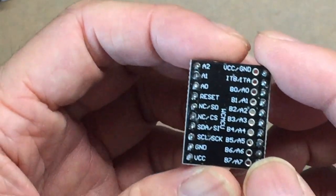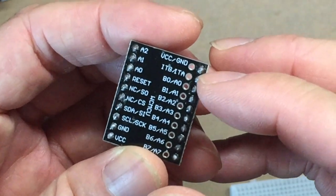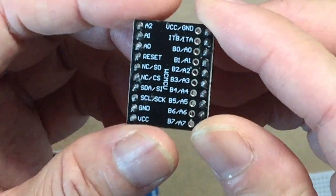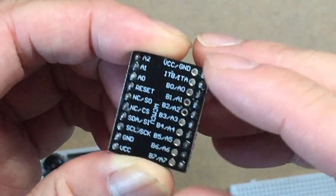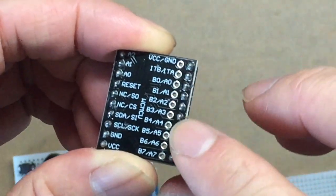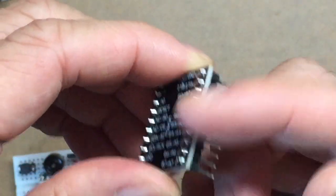And luckily the rightmost row of pins is for the A0 to A7 that we need to control all the buttons. The B0 to B7 are used for some other functions, like in the expansion port, controlling the brightness of the LCD backlight, which we decided not to use for simplicity. So we can do well with just soldering 2 rows of pins, one on the left, one on the right, and skip the one in the middle.